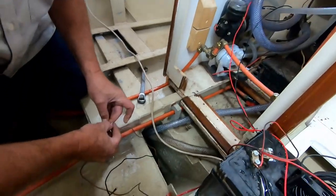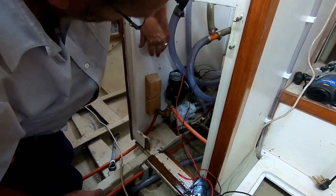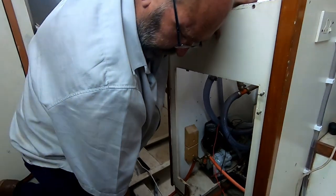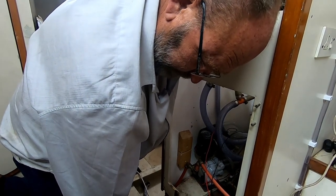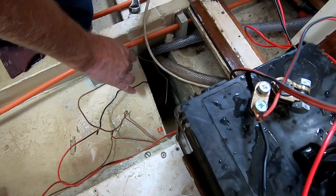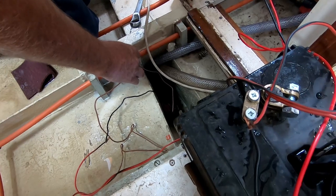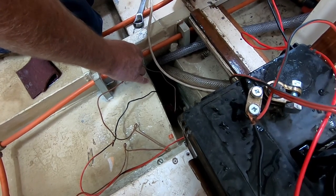You can hear the water coming out as well. Let's just check for leaks. This one's leaking there, and that's only by the exhaust. So it should pump it out to a certain level and then it would discontinue with the float switch, but there should still be water left in. Look at how fast it pumps — and that's only a 380 gallon per hour pump. So the last bit will have to do with the manual bilge pump. We're going to put the automatic pump on a light as well, so we know when it activates — put a buzzer or something.